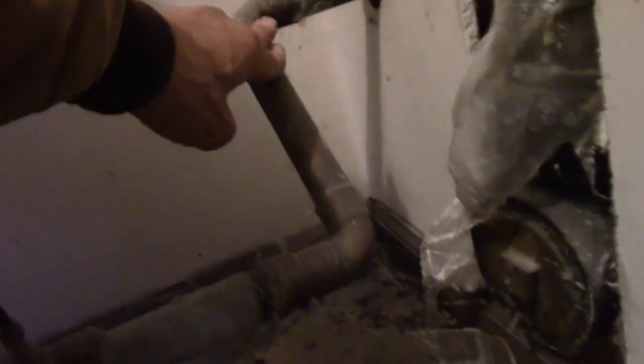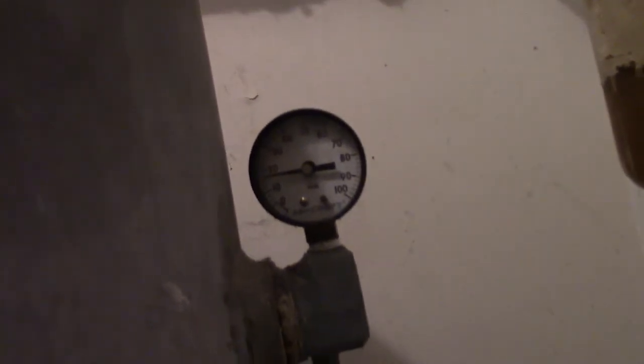So this comes from the cistern and it's got a pressure gauge on it. There's about 15 pounds of pressure here from the cistern. So rather than have water spew all over for an undetermined amount of time, I'm going to pump out the cistern. If I could get that pipe dry, I'd like to sweat the cap on it.